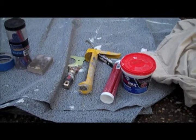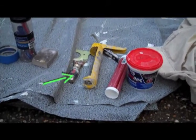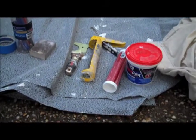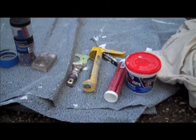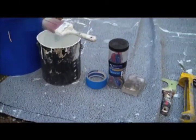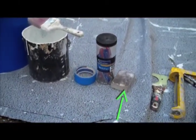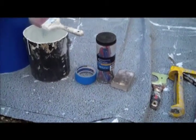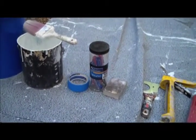Also to the left is a 5-in-1. It's a basic painting tool — we use it as a spackling knife but also to open up gallons of paint. Once your spackle is dry, you really need to take the time to sand that spot correctly. Instead of sandpaper, I recommend a painter's sander block — just give it a light sand and you'll be ready to roll.